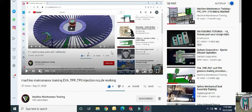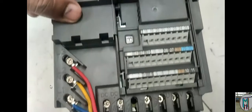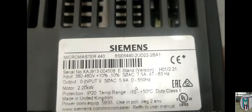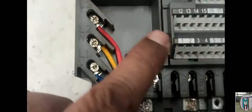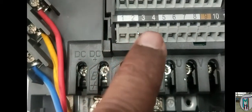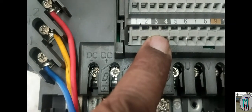Today's chapter is drives — this is the Siemens main drive. This is for a motor of 2.2 kilowatt capacity. For this capacity of drive we can fix a 2.2 kilowatt motor. This is the L1, L2, L3 — this is the input supply of our drive. This is the output for the motor: U, V, W. You can see here, and below the point, this is the terminal box.